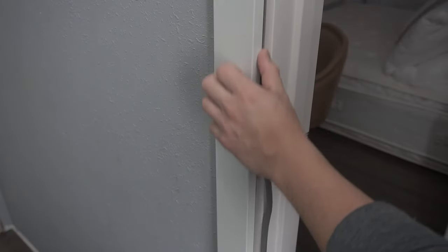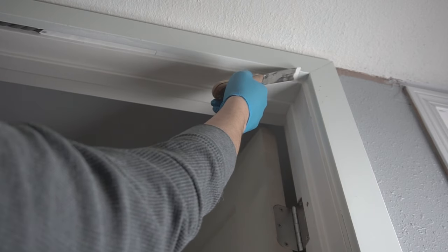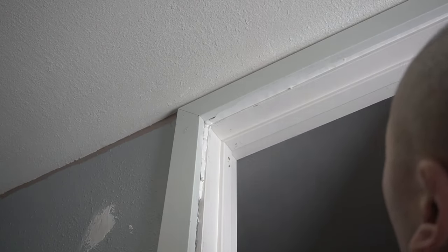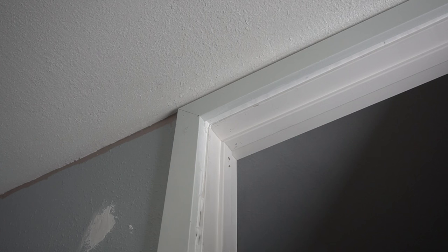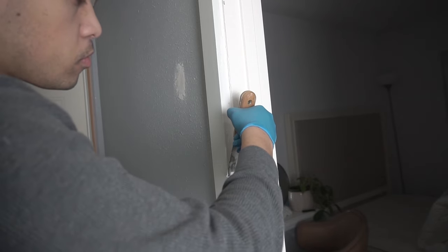For Method 2, which I made a more detailed video on, you're going to fill the rest with backer rod. I only had about a half inch backer rod so I had to twist it to make it fit. Then you're going to build it up with caulking — be prepared, you'll be using a lot of caulking with this method. Use your putty knife to clean up all the edges and continue filling with caulking to build it up. The more backer rod you use, the less caulking you'll need. Finesse it with your putty knife to get it nice and squared.